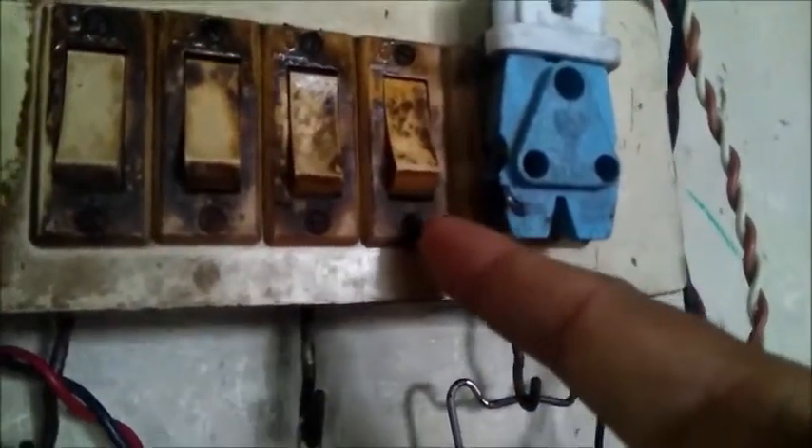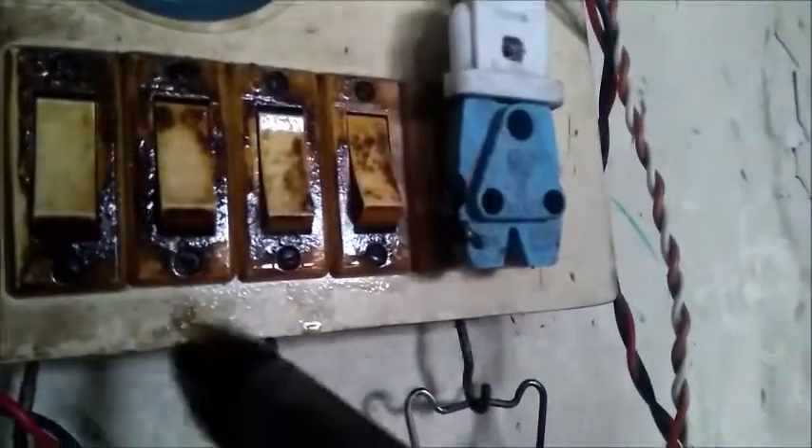Keep it like this. You may need to apply the kerosene for some time — let it dissolve and then apply the liquid again. Now this is another switchboard which has been neglected and contaminated because of dust, dirt, and careless regular use. Applying the same kerosene solution to this. I may have to reapply if it evaporates. See, dirt is coming down.